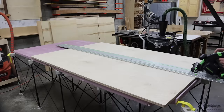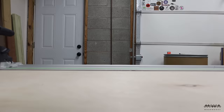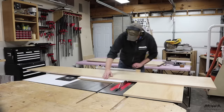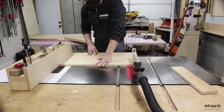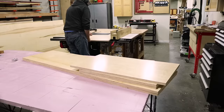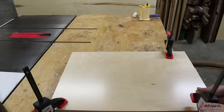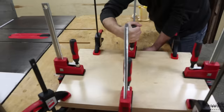Now I need to cut my case parts out of three-quarter inch plywood. All the plywood parts come out of a single sheet, which is pretty nice — the track saw makes quick work of this. I then cut my dividers and shelves to width. Six plywood parts in total. The center divider gets glued together, so I spread an even layer of glue with a roller and find all the small clamps I own to get a good seamless glue-up.